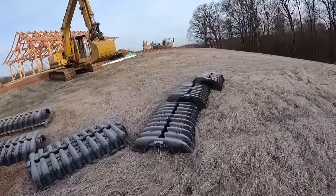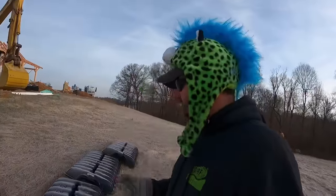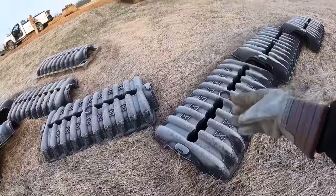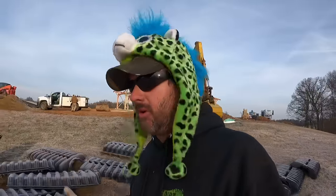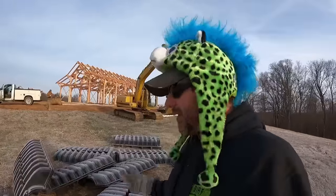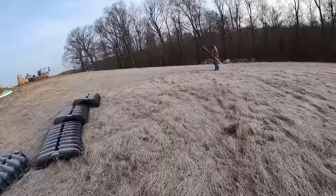All right, guys, so the septic system we're going to put in today would probably be what most people would consider to be a little bit more of a conventional system. We're actually going to use the ARC 36 chambers. These are low profile. The limiting layer you hear us talk about in all the other ones is actually quite a bit lower here. We can dig up to 24 inches deep. So with the 7-inch profile chamber, we can still get 12 inches of cover over them, so we can sink them in the ground and not use the Presby sand line system.